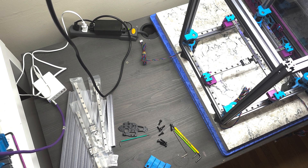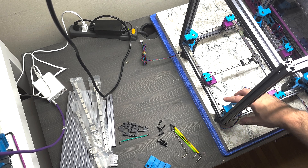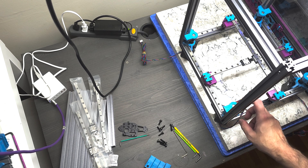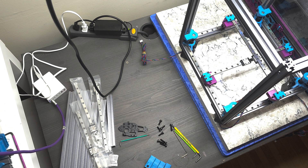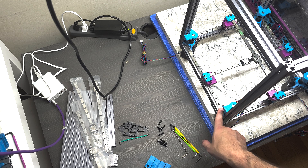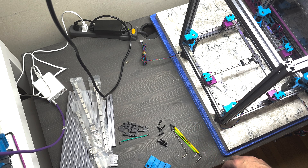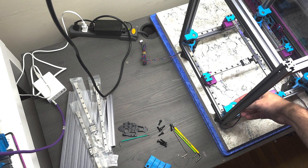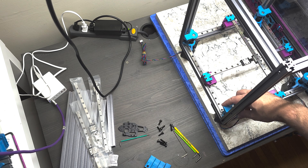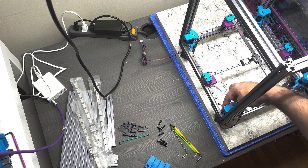Hey everyone, Steph here from Old Guy Mills Plastic. In my previous video I had installed the XY corner towers, the XY motors, and I missed the final step in that chapter of the installation instructions, which is to install the endstop caps along the edges of the linear rails. So what I'm going to do now is remove the bottom of the corner tower assembly so that I can get at the screw holes which are underneath, because there's not a lot of clearance here.